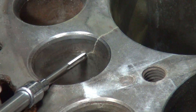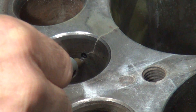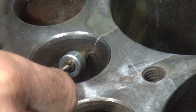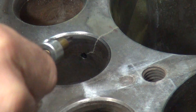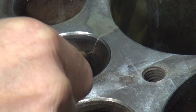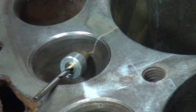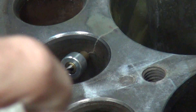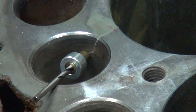First thing I'm going to do is put this hole in here. We've already drilled out with this drill right here with a stop on it, so we want to make sure we duplicate this angle — figure out what angle exactly I had it in there at. Obviously it was over here, so I'll put the tap in here and drive it through the same angle. Get my cutting fluid here and give this a go and see what happens.